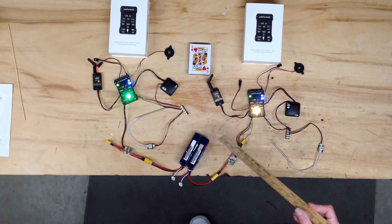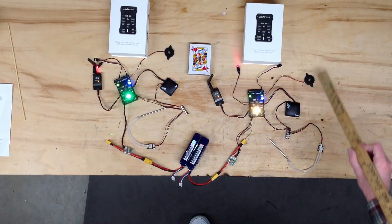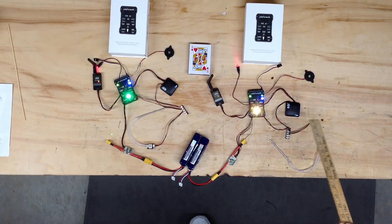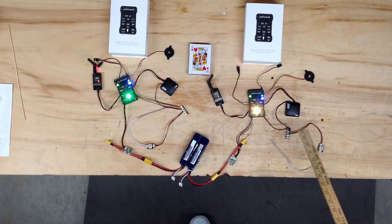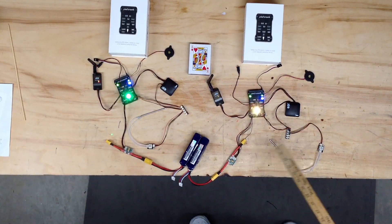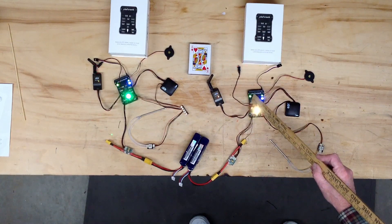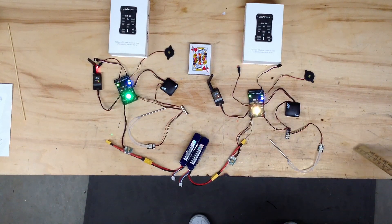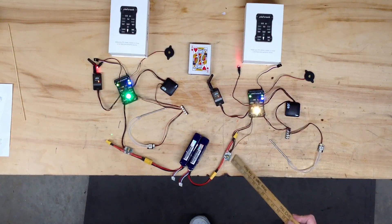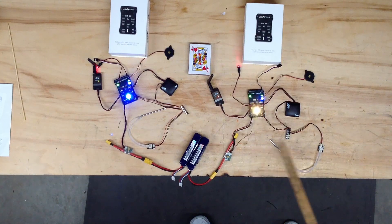This is an arm safety indicator button. This is a piezo buzzer and it makes all sorts of different noises depending on what's going on — from low battery to no GPS, whatever. I might just unplug the thing. The on-screen display attaches to this connector instead of going in a Y connector with the telemetry radio like on the APM 2.5 and 2.6. This is your normal voltage/current meter for reading those values inside the autopilot.